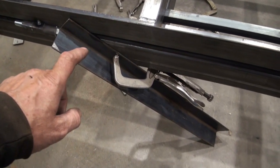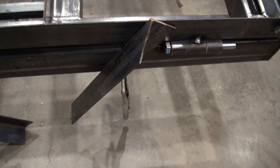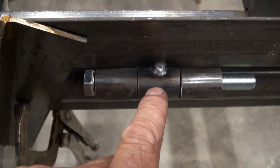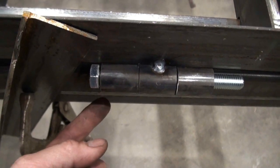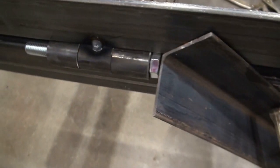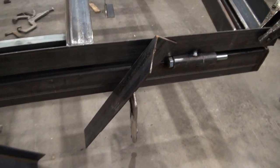I'm using these temporary angle pieces as a stop for the swing-out ramp to line up with the frame. I've got a spot weld from the center piece to the swing-out ramp, and the end ones are spot welded to the trailer. I'm not sure how this is going to work — if the geometry is going to be reasonably good. I'll take these pieces off now and swing this open to see how it looks.